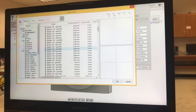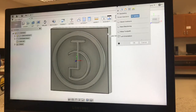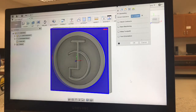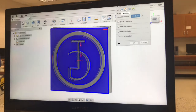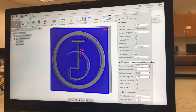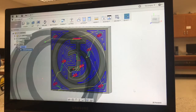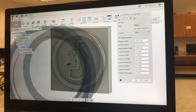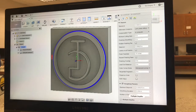I changed to the CAM environment and then I selected a 1/16 flat end mill to do the process with. I used a 2D pocket, selected the desired places, and set my multi-pass depth. Now if you notice at the top and on the sides, it did not go all the way around. So then I went in and used a contour, selected the outside circle, and did two passes on that at multiple heights.